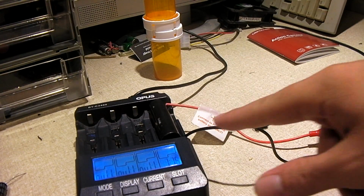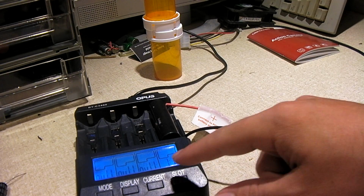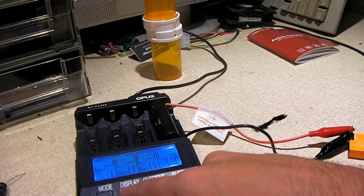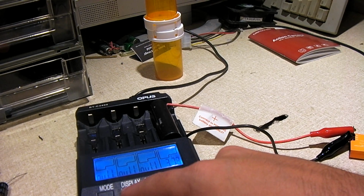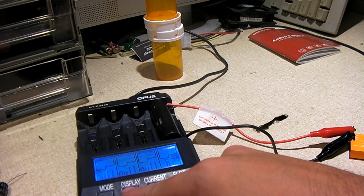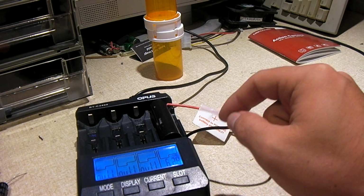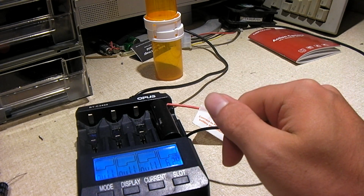Okay, so the battery discharge here has been going for an hour and 15 minutes now. Still discharging at 500 milliamps. Current voltage is 3.73. We pulled 624 milliamp hours out so far, so things I think are looking pretty good.